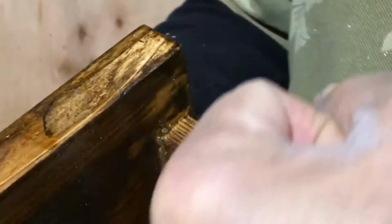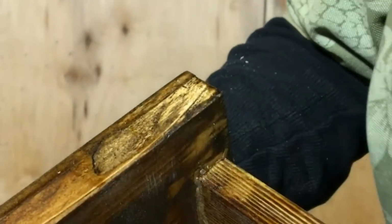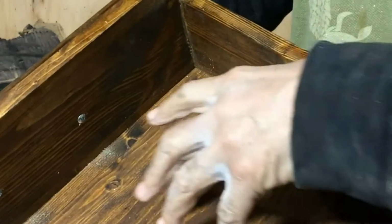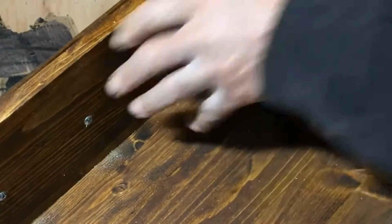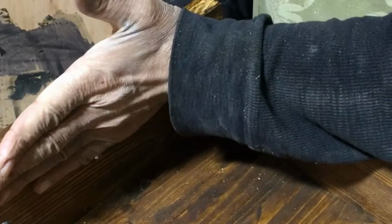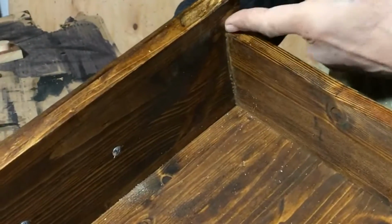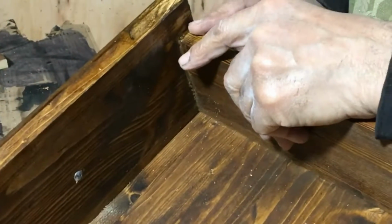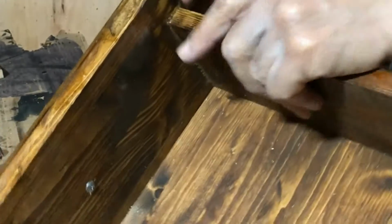So every time this drawer slams, it's like hitting this, and hitting this. And if there's weight in this drawer, the weight wants to stay still, or the weight wants to continue. So if you have weight in the drawer and you slam the door, the weight's still trying to go in that direction. The drawer is going to stop at the face of the cabinet, and this is going to eventually pull loose because the tensile strength of whatever this joint is dependent upon that.